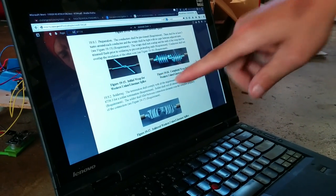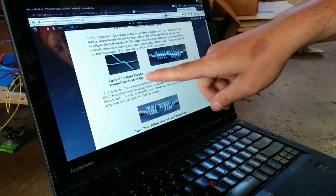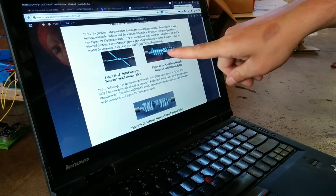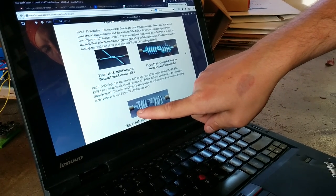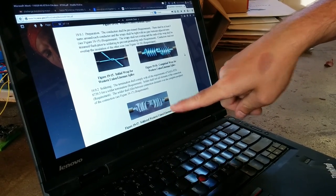There's a document that explains how NASA standards are for splicing wires together. They start with two wires like this, then wrap each one around the other one, and then put solder across the entire thing. I'm going to show you that with these two wires.